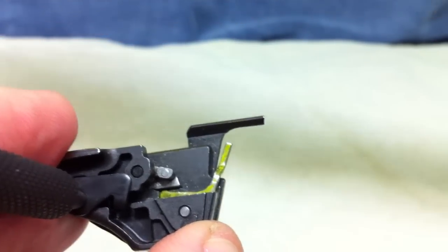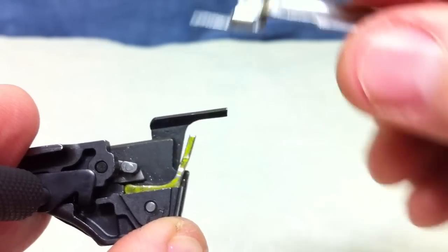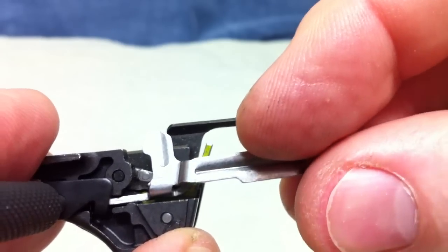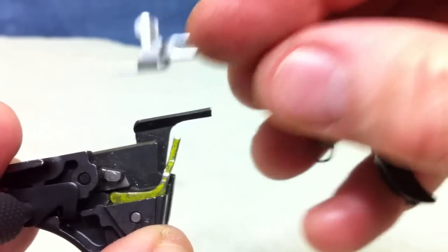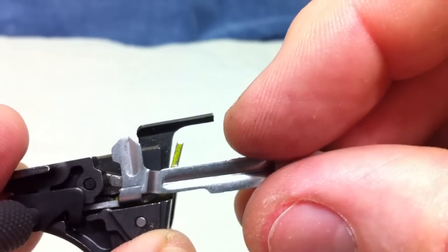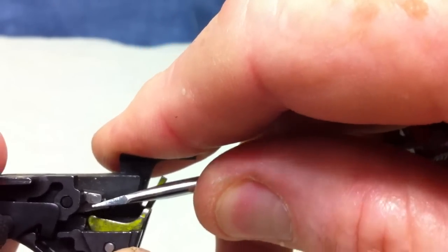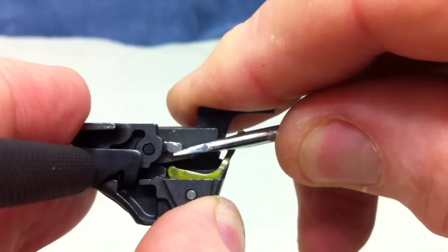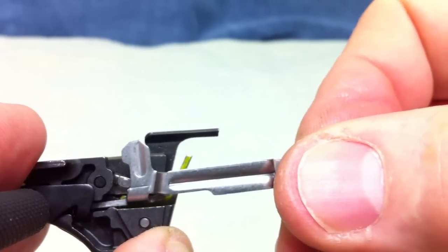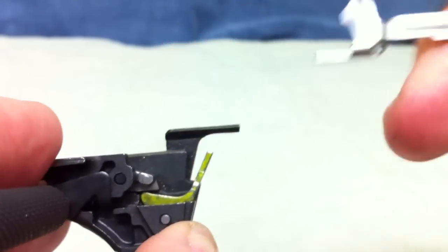Let me show you what is happening here. Here's the trigger bar and what happens is when you push down on it, it allows the trigger bar to go in there. You can see how that trigger bar is going in there — the trigger bar is going to slide and it's going to hit on that section right there. That's the sear, and as the trigger bar is going in, the loop on the trigger bar is pushing the sear up. This is under spring pressure — when the sear gets up to straight level, that's when it releases the striker. Getting back to the trigger bar — trigger bar goes in like that and contacts the sear. When you have it in the safe position, you'll see this trigger bar can't go in.